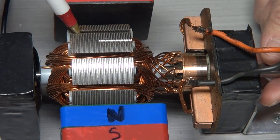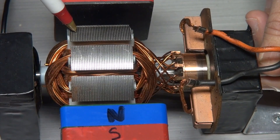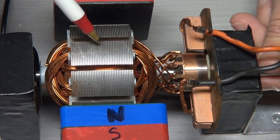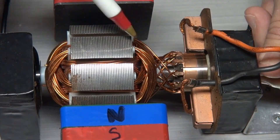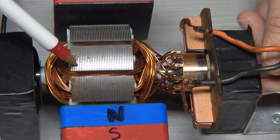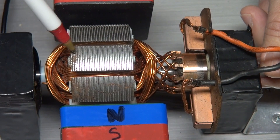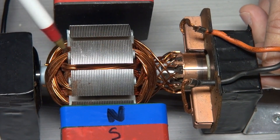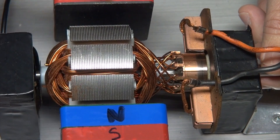The rotor is made out of numerous poles. Each of the poles are paired and designed to produce north and south magnetic poles. Between the poles are slots where copper wires or conductors are inserted in a loop configuration. The rotor is also made out of iron core — individual plates stacked together to improve the interaction between the magnetic fields produced by the poles against the stator assembly magnetic fields.